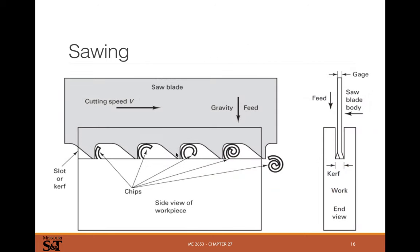Sawing is similar to broaching, except here there's no difference in height on the teeth. We essentially feed the part in and remove chips in a similar way — little teeth with a gullet that grabs the chips. The chips get stored there until the saw leaves the part. Sawing teeth will usually have a kerf so the actual cut width is slightly wider than the thickness of the saw blade, which clears chips and reduces rubbing friction.